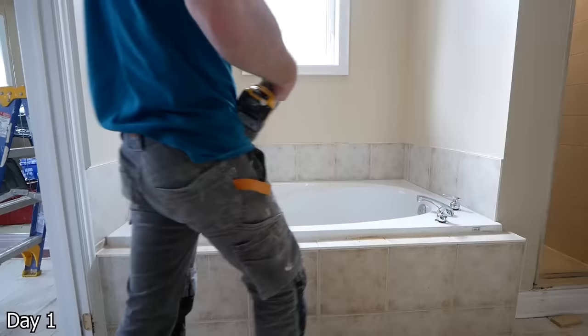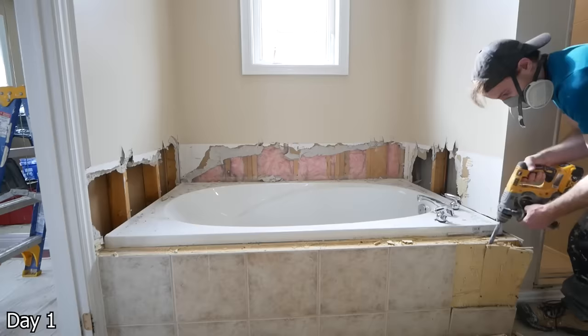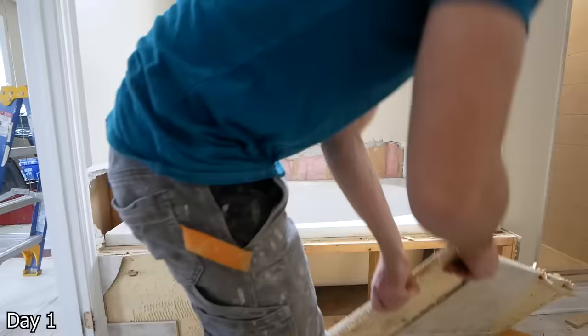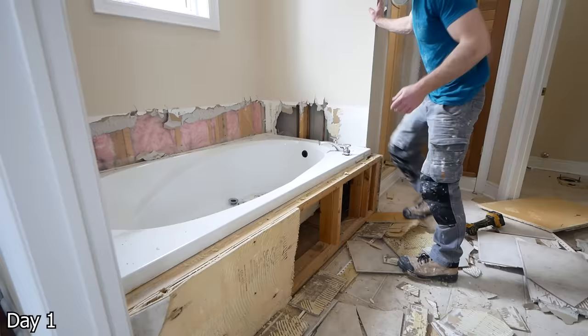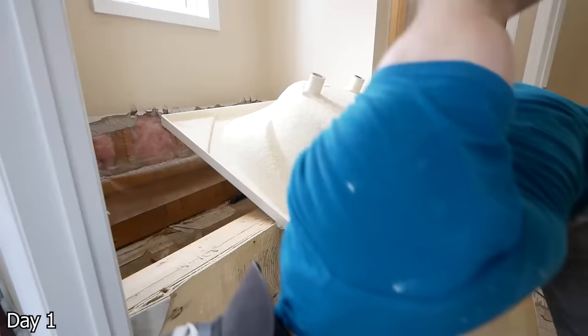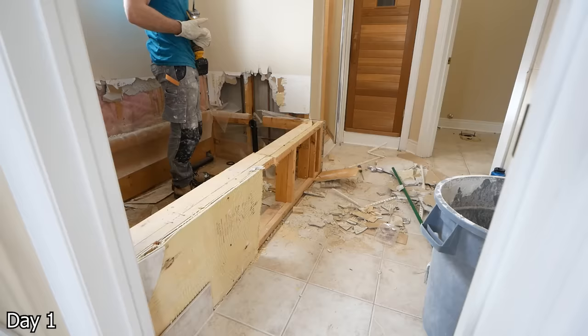In order to remove the tub, I take out the surrounding tiles as they're kind of locking it into place, and then open up the front side to get access to the water lines. You want to cut these off — otherwise when you try to lift the tub, it will be tethered down and in place. Then using a drain removal tool to get the drain out, and the overflow is just a couple of screws. That being done, I can just lift it up out of place and then take the sawzall to it — same reason as the vanity top, just makes things easier.